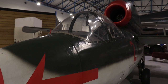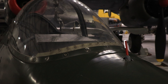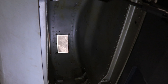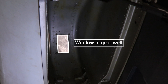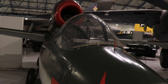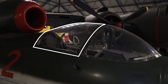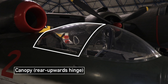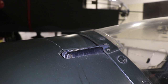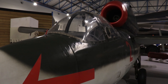Above the nose there is a small tab — this is the landing gear position indicator telling the pilot whether the nose wheel is down and locked. He also has a window in the gear well which gives him another visual clue. The large forward windscreen gave good forward visibility. Just behind the instrument board, the windscreen connects with the canopy. The canopy itself hinges upwards at the base where it meets the fuselage, and it does have to be closed when the engine is running.